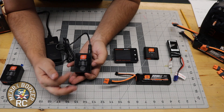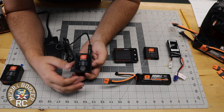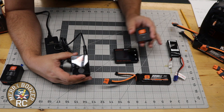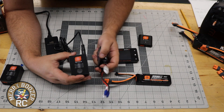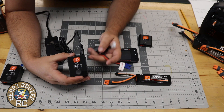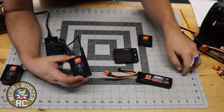We're going to put ours on LiPo. The nice thing about the S150 over the S120 is that with the S120 you can only charge smart batteries, whereas on the S150 you can charge any 2S to 4S LiPo that's over 200 milliamps. You just plug it in with an adapter if needed.